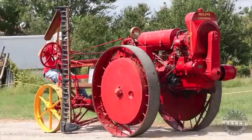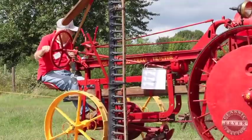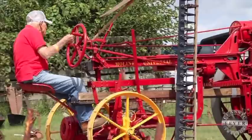And I salvaged almost all the castings and the articulated steering castings. I was able to salvage those because the firemen never threw any water on anything. So they laid there in the hot ashes and cooled naturally. Cast will do that. No cracks. It didn't crack anything. And when I learned that they didn't put water on it, I felt safe in taking a chance. The guy wanted $25, like that's what he could get for it at the junkyard, so I gave him $25.